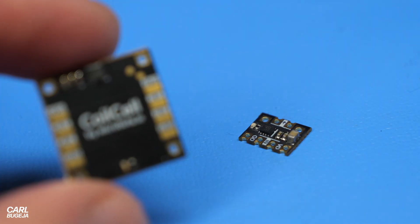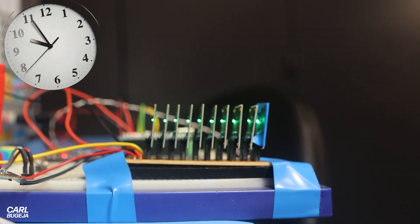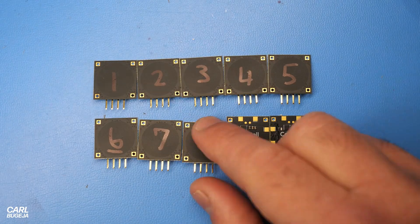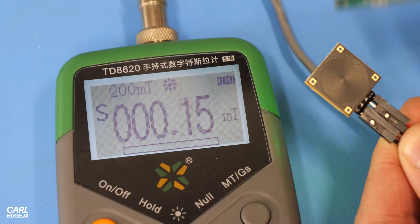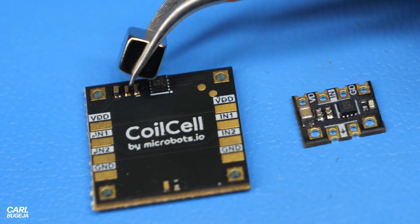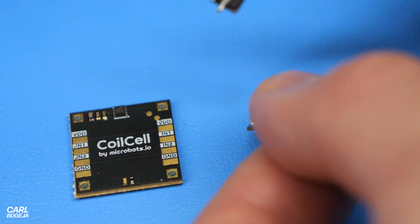That's what I did here — we have the same exact circuit on a four-layer board. This was tested for days to make sure that the heat generated by the coil doesn't affect the circuit. Over time, the copper underneath the coil also doesn't affect the magnetic performance. Fun fact: it's only affected when the magnets are moving really fast, as in PCB motors. The only thing that was magnetic was the 22 microfarad capacitor, but going for a smaller package minimizes the effect.